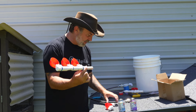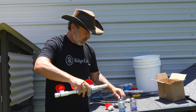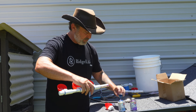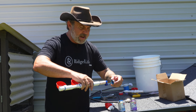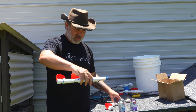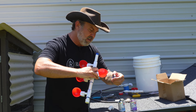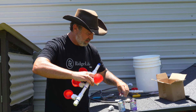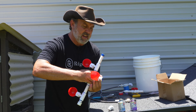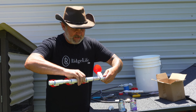I'll straighten all the cups out at the end because they're not glued. The next piece is this fitting — applying primer and cement on the inside and outside. This one's a little bit short — slide it all the way in, quarter turn, there we go. Now the last piece on this section is my elbow. The elbow's going to go straight backwards — that's the part that's going to go through the fence.